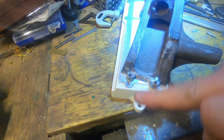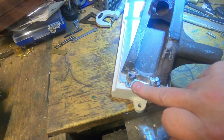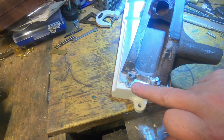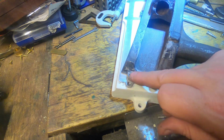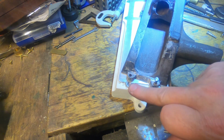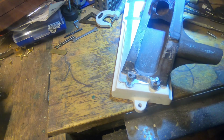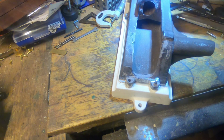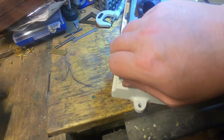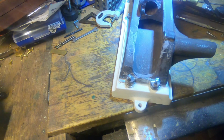I'll show you this. We had a misfire here. I've drilled this slightly off because this wandered, and I've since filed the hole out to the right spot. And I put an aluminium plug in there and a little bit of JB Weld on top just to smooth it over. You can't actually see that, but that should be as good a repair as the rest of the casting. And sometimes these things happen, but I would rather have these in line than out of line.